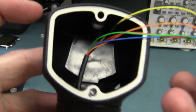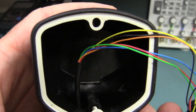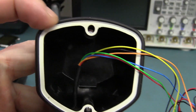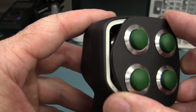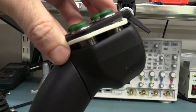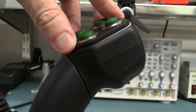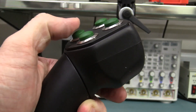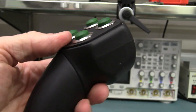And just a small thing like putting heat shrink over the wiring which goes through the cavity there, just so it doesn't rub against the inside. I know there's no movement on here once you've physically installed it, but it just shows attention to detail — I really like it. And of course you've got rubber o-ring seals as well, because you can't have the operator spilling their coffee all over these buttons.